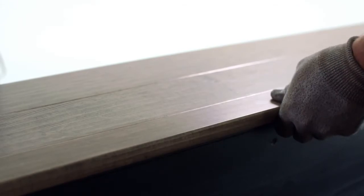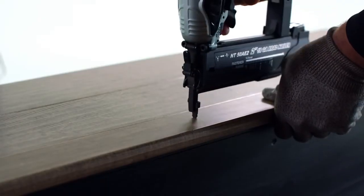If you're installing the hardwood floors on stairs or at a step down, you'll need a stair nose. There are flush stair nose and overlap stair nose options. The flush stair nose is used for nail, staple, or glue down installations, while the overlap stair nose is used for floating floors. Be sure to sweep or vacuum without using the beater bar and clean the floor with a proper wood floor cleaner. Don't use oil-based products on your hardwood floor as it can cause a buildup that dulls the appearance. Store any unused materials in a dry place in case repairs are needed in the future, and always use plywood or hardboard as protection when moving heavy appliances or furniture across your new floor.